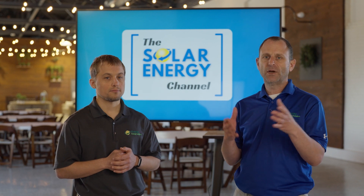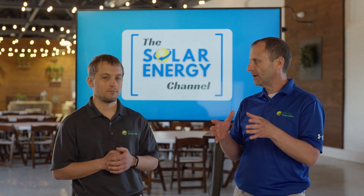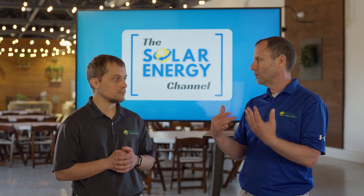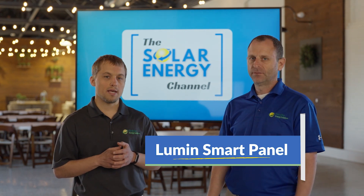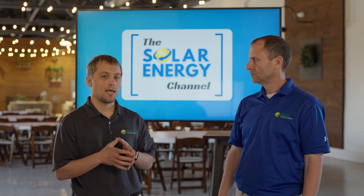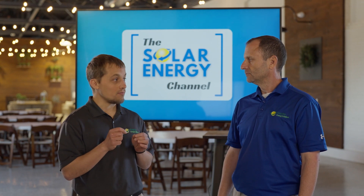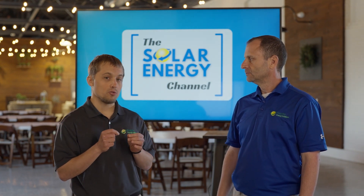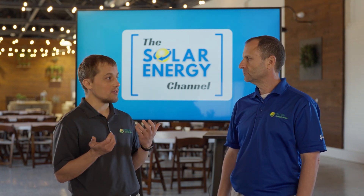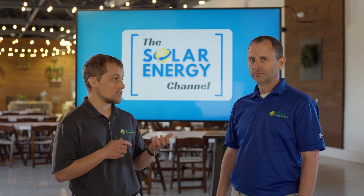So let's talk about that. One of the primary solutions that we use is a Lumen panel. The Lumen panel is a device that gets installed next to your main breaker panel in your house, and what it does is it physically intercepts some of your circuits so that you can control those loads on an app. You can schedule those loads any time of day or any day of the week, and you can turn those loads on and off remotely as you wish.